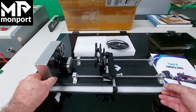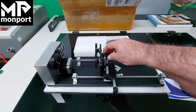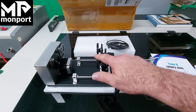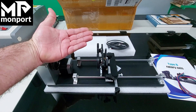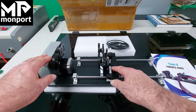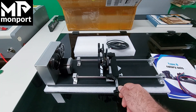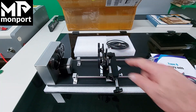That's all there is to the assembly of the roller accessory. On the top you have a vertical knob — this will raise or lower the side should you have an object that is higher on one side than the other. When you've got it in the right spot, you'll tighten the bottom so it doesn't move, and then tighten the top so it doesn't move up or down.